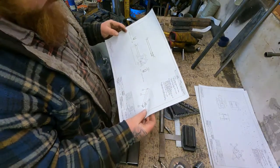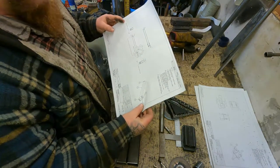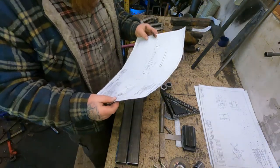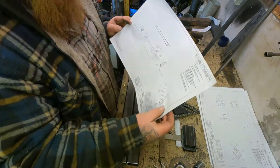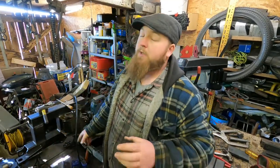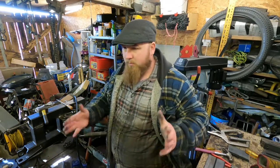Right, so the stabilizer legs, arms, outriggers, I'm calling them outriggers, calls for 50 by 50 box section. If I'd realised sooner, I would have ordered slightly bigger. And the reason I'm saying that is because the box section it's going into is 100 by 100. Now, when I put the plates on the outside, that then makes it 100 opening.